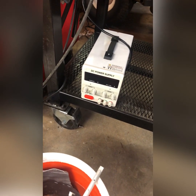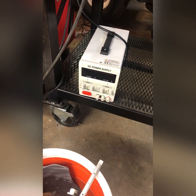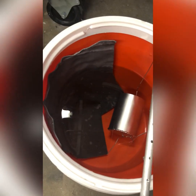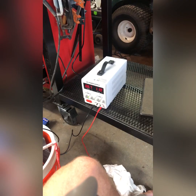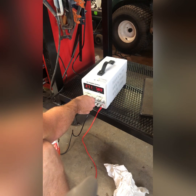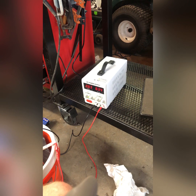You want to make sure the knobs are all the way down before you start — you don't want to cook your hanging wires. If you were anodizing something much bigger before and come back to do something smaller without resetting, it'll pick up where you left off, so turn the knobs all the way counterclockwise before you turn it on. Also check the clearance of your part inside the bath — you don't want it touching your cathode or it'll short out; it needs to be suspended in the solution, not touching anything except the hangers. I turn the voltage knob almost all the way maxed out so that when I start to turn the amperage knob up, it'll hold constant amperage and compensate for the voltage required on its own. I slowly ramp up the amperage over about five minutes until I get to 3.67 amps, as determined by the 720 rule calculator.